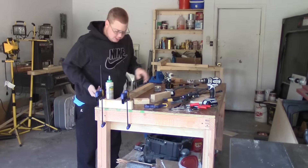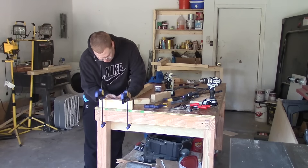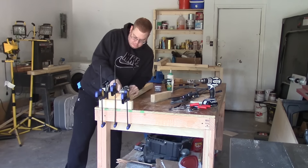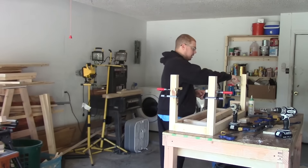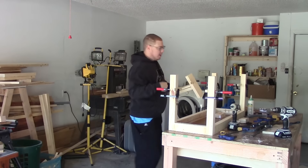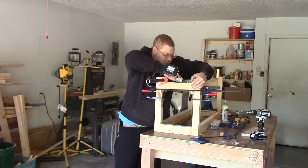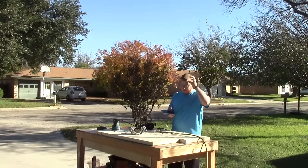I've been thinking about it for a day or so and I decided I'm going to put some braces on these legs to help strengthen them up. I've got lines marked where this is going to go, and to help secure everything I've got a little system set up. I repeated these steps for all four ends for the braces. I clamped some scrap boards across the ends — this is to help hold the brace in place until I can secure it with glue and screws. The first thing I'm going to do is add some glue, then once it's clamped up I'm going to put the screws in — two screws per location.